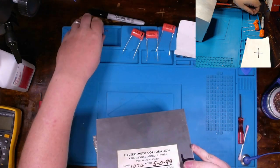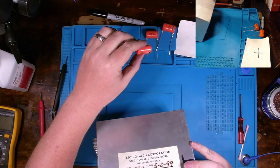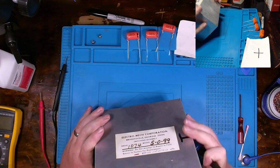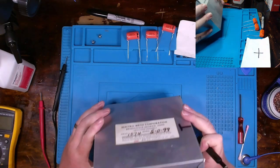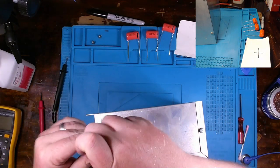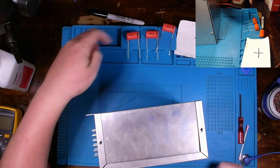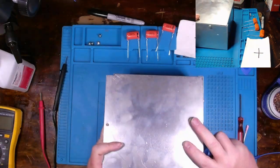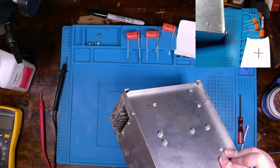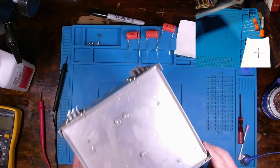But herein lies the one that I troubleshot earlier while I was waiting on these Sprague P10 0.1 microfarad 600 volt rated caps to come in. As you can see, I went through and marked the outside foil on these, and they were all pretty much on the same side. I did that with my marker, as I typically do. But oddly enough, forgot, this one's going to have to have this covered piece come off too.